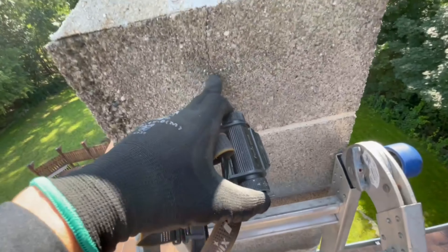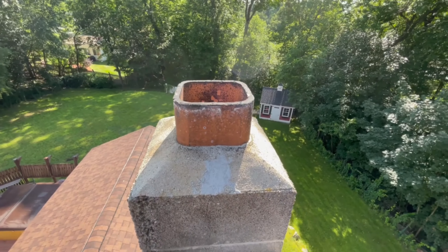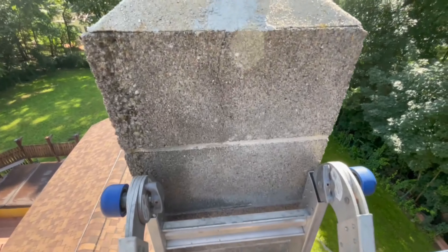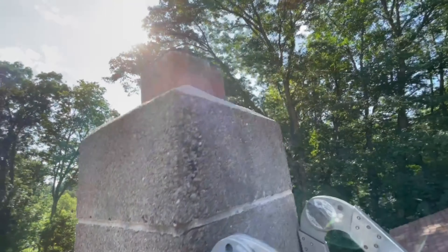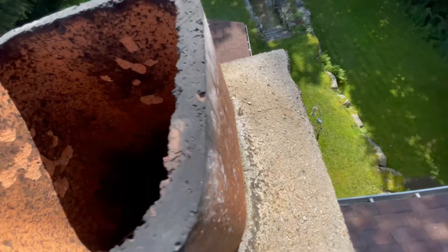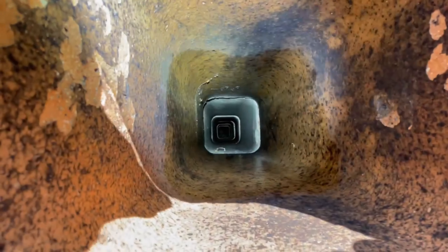This chimney block is cracked at the top, which is typical — there's no bond breaker on the flue so it's going to crack. This wear mark is from condensation from the boiler dripping there over the years; it had just a rain cap that clips onto the flue and the drip mark is here, so we'll have to patch that. You notice there's no horizontal lifting on this one as far as the block work goes — that usually only happens with a wood appliance. The crown wash isn't bad, just a couple cracks where it needed a little relief to expand. The mortar joints are all gone in here.